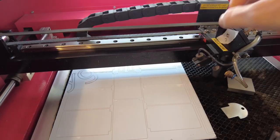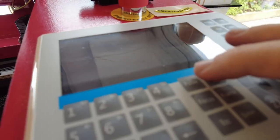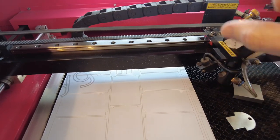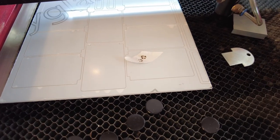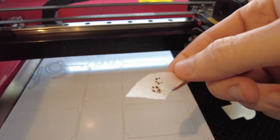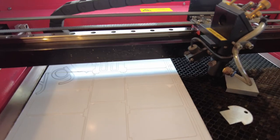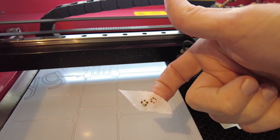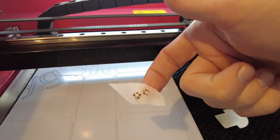What you do is stick a piece of masking tape over the mirror and on the controller there's a button that says pulse — you hit it, it fires some laser light and it should create a pin prick. But what actually happened was not a pin prick but a weird halo circle effect, which I have never seen before. This is my second laser machine and I've used lasers on and off since about 2004 — I've never seen that. To me it seemed like something weird was going on with the tube, or god forbid the power supply.